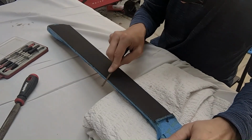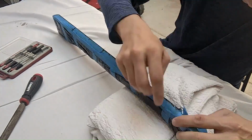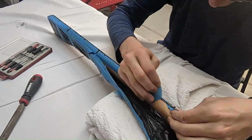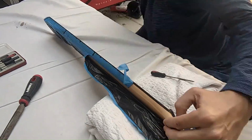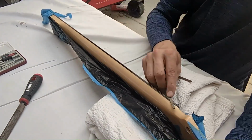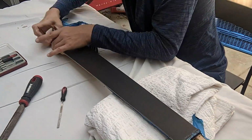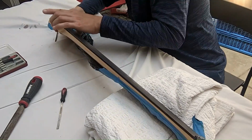Now, ripping off the Band-Aid. Of course, in our case, do it extra slowly. As a first step, take a fine file and go around the edges in a 45-degree angle. This helps the epoxy to break along the right line. There are spots with a little buildup, special care here. Slowly peel the tape off.